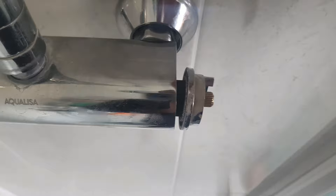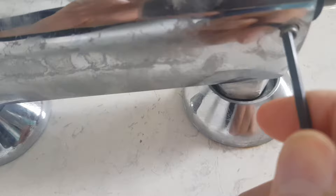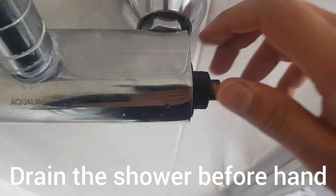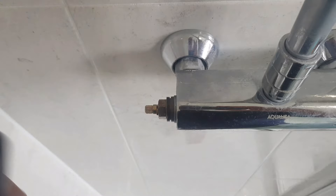Next is just taking off the actual mechanism which controls the temperature from going above 38 degrees. There's an Allen key that was needed to loosen the actual unit. Be very careful — you're going to see a mistake I made: I didn't drain out the water and it went everywhere. Here's one I prepared earlier — I put it back in so you could see it, but do be careful. I should have released it from that top unit and taken a lot of the water out.